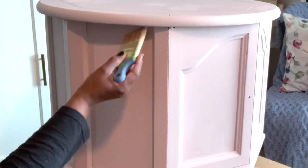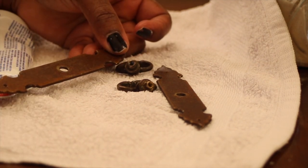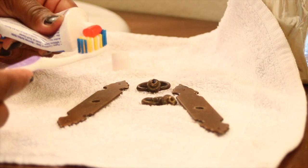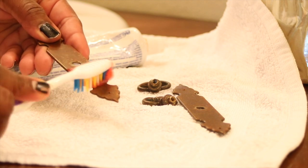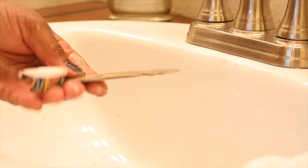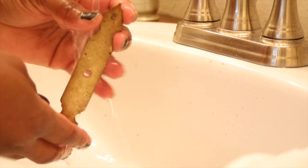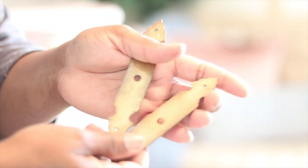Once finished with the poly acrylic, I'm going to go ahead with the hinges that were originally on the piece. I tend to like to keep the original hardware, especially on old pieces. Sometimes I like to mix newer knobs or handles with older pieces, but in most cases I keep the originals if at all possible. Here I'm going to use some toothpaste — it's a great product to use instead of another chemical to remove old rust and debris from brass hardware. The toothpaste does the trick excellently, as you can see, and it still has a little bit of an aged appearance which I really love. Here you can see the before and after of each one of the backings that goes on the piece, and then I'm going to go in and apply them back.